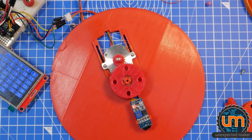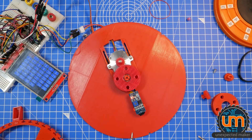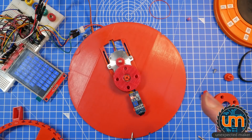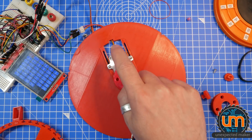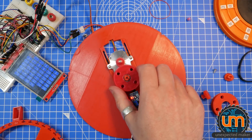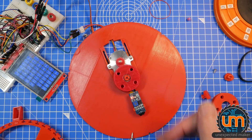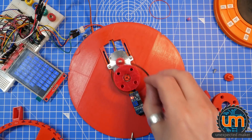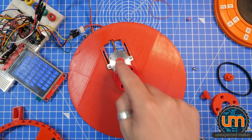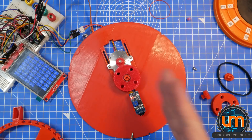That's what I did - I've gone back to a cog. But to be brutally honest, I feel like maybe I should just get rid of this gear in the middle and just put the stepper right in the middle. I know it's been suggested by a few people. The reason I did the gearing in the first place was my assumption that if I geared it up and did a lot more rotating on the stepper, I'd have more accuracy because I'd need more steps. But clearly whatever I'm doing here with the gearing is just compounding the accuracy issue. The accuracy doesn't seem to be in how many times it's stepping - it seems to be in where it's finishing up, how accurately it's landing on its last step.